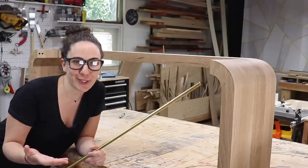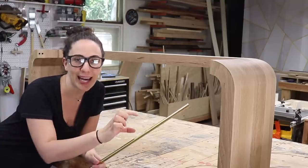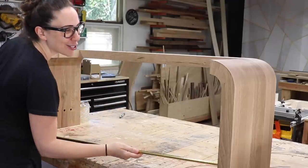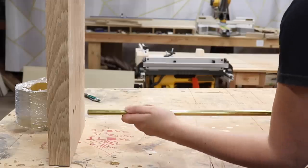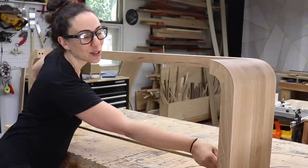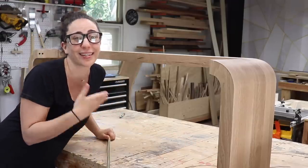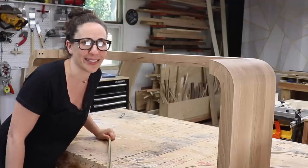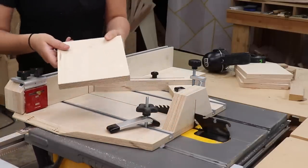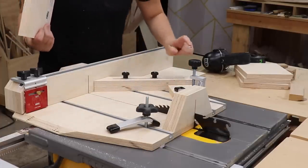I just made my first major mistake when cutting the brass rods. I measured how deep the holes were and meant to add that to the overall length, but instead I subtracted it. So now the brass rods are just a little bit too short. The simplest fix is to cut the stretchers just a little bit shorter — the bench is going to be a little less wide than I planned, but it happens. To help with clamping, I'm going to make some clamping squares by cutting away at one corner using my adjustable fence on my cross cut slide with a stop lock.